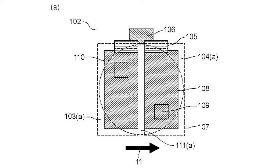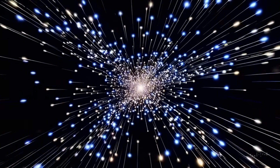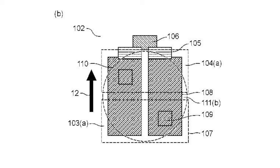For the rest of us: every pixel is made up of tiny photoelectric conversion units, and those all share a single microlens — like a miniature funnel directing light into an electron trench. This is where the magic happens. Photons hit, electrons wake up, and we get a digital image. In some pixels the photoelectric conversion units are arranged side by side; in others they're stacked top to bottom. Because the autofocus needs to detect contrast in both directions, the pixel layout is doing a clever little dance to make that possible.